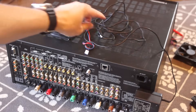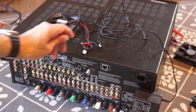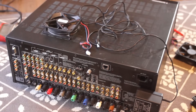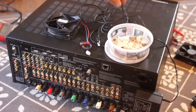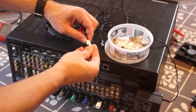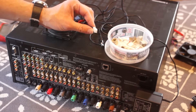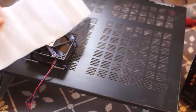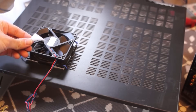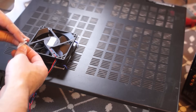On the rear of the receiver is an outlet that switches on when the unit is powered up. The two power connectors are obviously not the same, so I grabbed a three-prong connector that I had desoldered from some printed circuit board in the past and matched it up. I also realized that zip tying the fan directly to the case made it even louder, so instead I trimmed these corner spacers from some shipping foam and shimmed up the fan a bit.